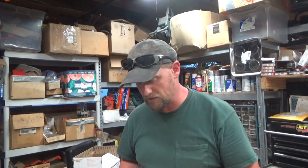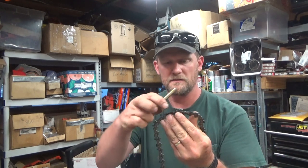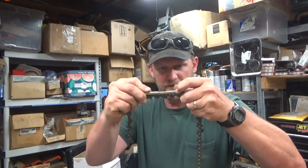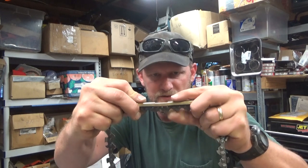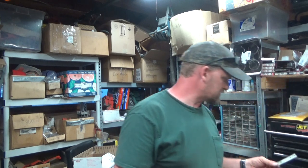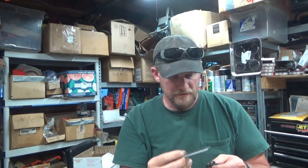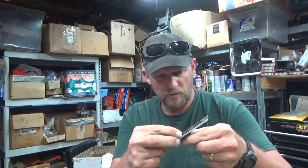There are a bunch of different types of depth gauges. This is probably the one people are most familiar with — it fits over two teeth, and what's sticking up in the middle is what you should file down. It just sits on top. That's a piece of factory stock never-used chain, and you can see there's just a smidge of a nubbin sticking up. If you were to hit that with a flat file, it would come off with probably one stroke.